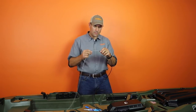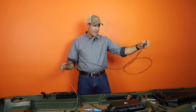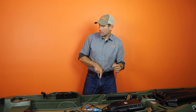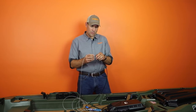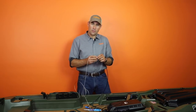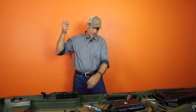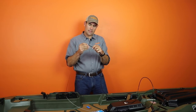We'll put that aside. The cable in this case, you really just insert in the tubing as a means to stiffen up the tube. The reason you want the tube stiffened up is that it's been coiled like this for a long time, and as soon as you put it in, it wants to go inside the boat and curl around in there. So this just gives it a little bit of rigidity so that when you start threading it through, it keeps pointing towards the back. Typically, people who have done this installation before on other boats just use the bare tubing and reach in with a coat hanger and grab it and pull it out. But stiffening up the tubing helps, and it helps to actually have somebody hold the other end and straighten it out to get this thing in there.